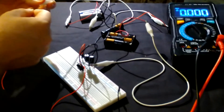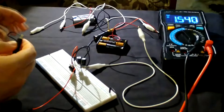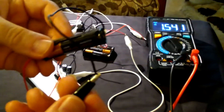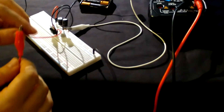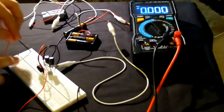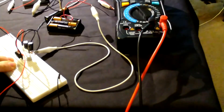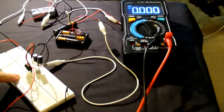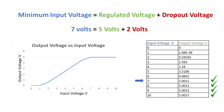I'm going back to use one battery — this is 1.5 volts. The multimeter confirms it is providing 1.5 volts. I connect the ground and the red probe goes to the output. When I connect this 1.5 volts, nothing happens. The voltage regulator needs a minimum input to provide the regulated 5 volts due to the dropout voltage. For example, if this regulator provides 5 volts, I have to provide an input of 5 volts plus the dropout voltage.